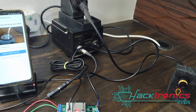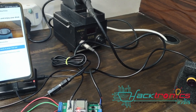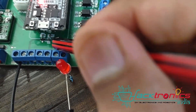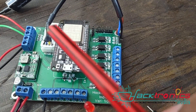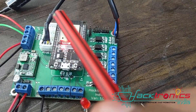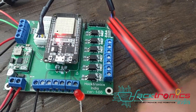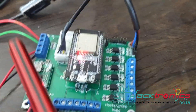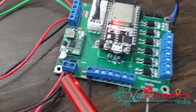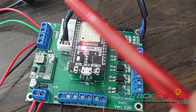As soon as I place the cup, it will start dispensing the beverage and create a trigger. For tea it will create a trigger on the tea line, and for coffee on the coffee line. This board is designed so it can be placed on any machine without modifying the actual control board - you just bypass the input and output from the front control panel to the control board.